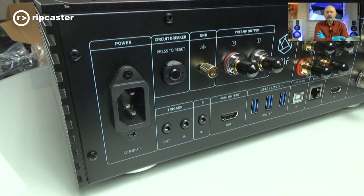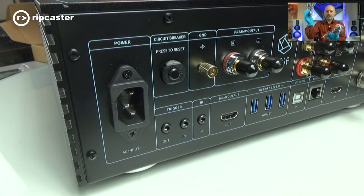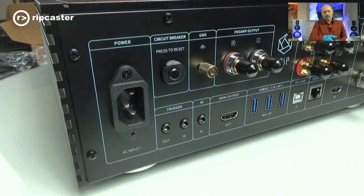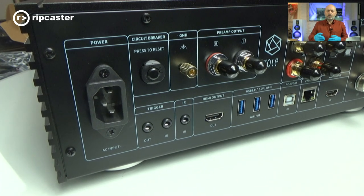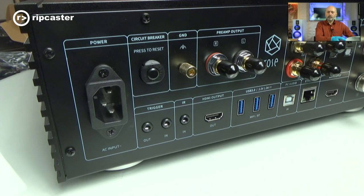So now let's look at the back panel in more detail. First up you can see the IEC input — we can connect any of the standard IEC cables included. It is a multi-international power supply, taking 50Hz, 60Hz, 240V, and 110V. Next to that is a circuit breaker: if the unit overheats or you short circuit the outputs, it goes into protection mode and that's how you reset it. Below that is a 12V trigger in and out for turning external equipment on or off. Next to that is an IR input for the accessory Magic Eye receiver, and above that a grounding post for common ground with other analogue equipment.